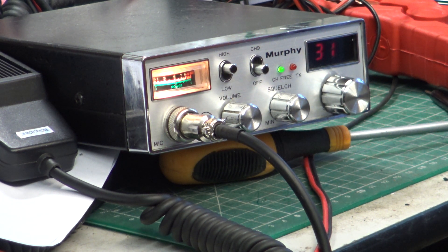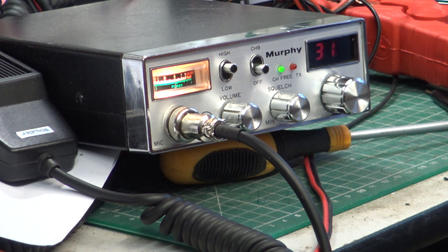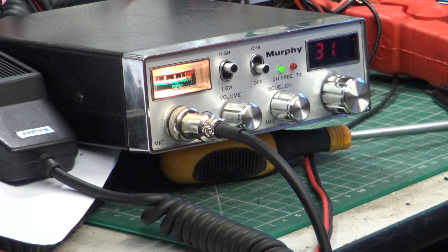I've connected this to a 12 volt battery and we've still got the same hum. I took it to our outdoor aerial setup on another building - a sentry box with an outside CB - and it's just as bad. It dawned on me it's perfect on the test set with a dummy load, and perfect on any other dummy load, but it's not perfect when it's on our aerial. I've checked the SWR on our Antron 99 and it's 1.7, and tested the aerial on the sentry box - also 1.7, presenting a similar SWR and getting a similar result. So we're getting the hum even on a battery.